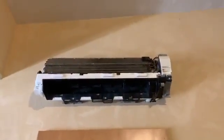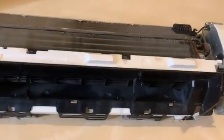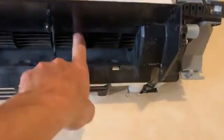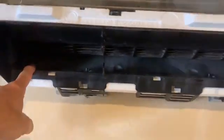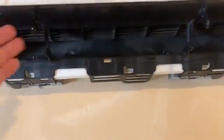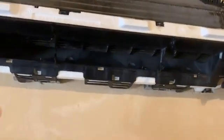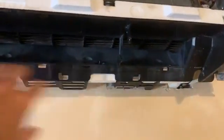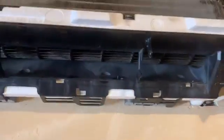All right, so now that you've got the casing off of it, what I've taken the liberty to do is, inside there's a wheel that spins. This wheel had a bunch of plastic clips, which you'll probably notice on yours, as well as rotating louvers that allow the air to rotate back and forth when on. I just went ahead and clipped off all of that stuff and got rid of it. Makes it a lot easier to clean this wheel rather than trying to get in between grills and grates and stuff like that.